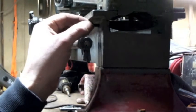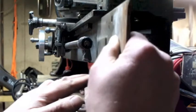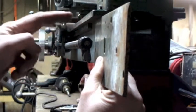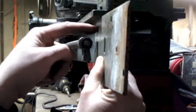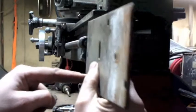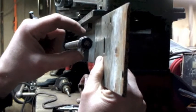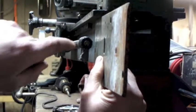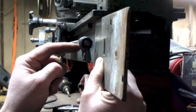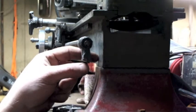The general idea is to cut a small piece of plate stock and have that sit behind here, drill two holes in it, and bolt it to the side of the bed. This wouldn't be anywhere near this big — we'd cut out a piece. Attached to this plate would be a small block that would have a hole drilled through it that the lead screw would ride in. That block would have to be quite a bit smaller than it is right now.